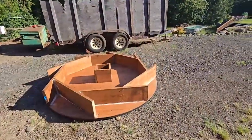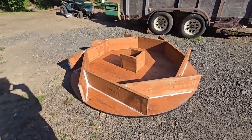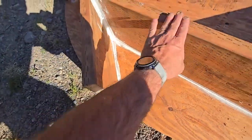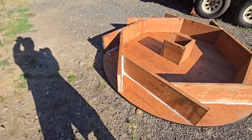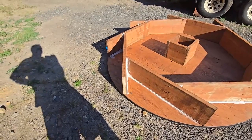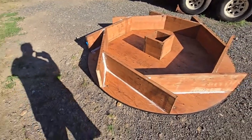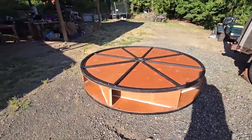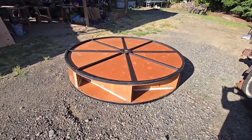The seven-and-a-half-foot wheel was made out of cable reels — I took the middle struts out of them. Those are two-by-twelves cut at 43 inches with a 45-degree on the end, and from that point straight across at 90 degrees is about nine and a half inches. The caulking is rubberized caulking — a tube broke so some of it looks rough, but it's flexible and should work well. That's the basic idea of our water wheel.